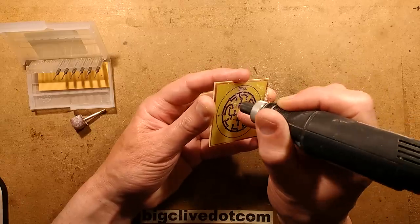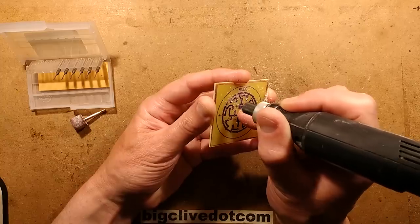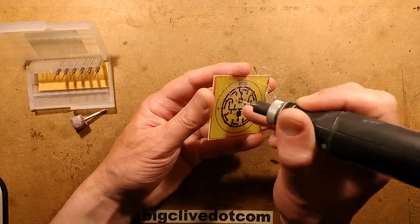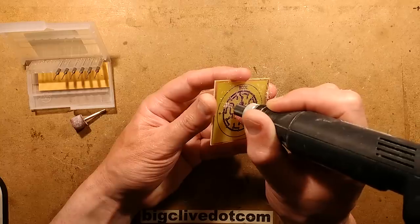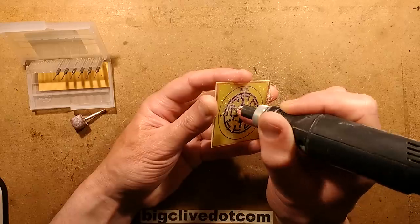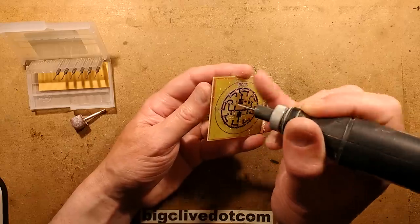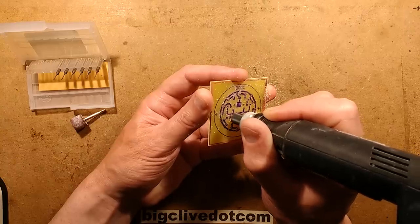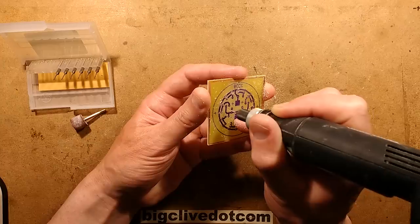Now, one thing about the tungsten carbide drill bits is they're very, very brittle. So you have to be very careful to support the drills properly. If you are sloppy about it at all, the drill will crack. You also want to avoid touching it to your flesh, because it's got a very, very bad habit of just snatching and biting into your skin. They're very sharp. It's horrible.